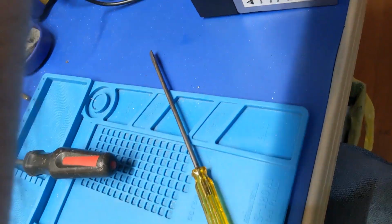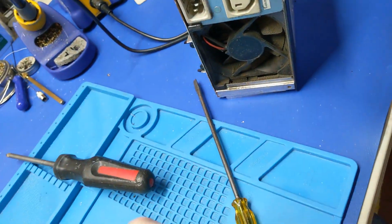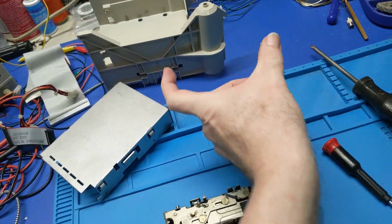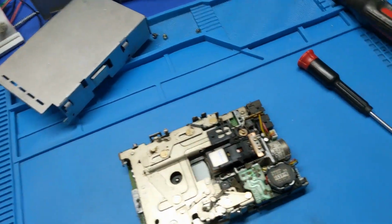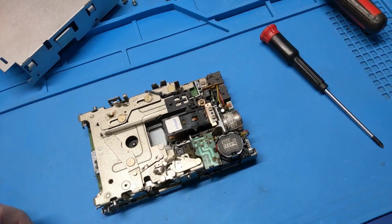Because the only way for the fan to vent out of the system, it's coming out of the rear, right? The only opening in the front besides the speaker area is the floppy drive hole. It's the path of least resistance. So guess where all the dust is going to get accumulated. Yeah, that's what happens to these.